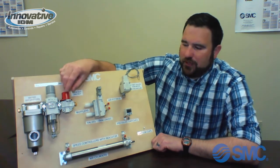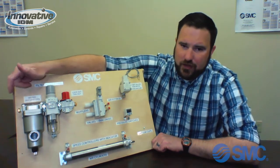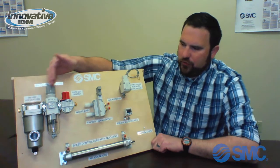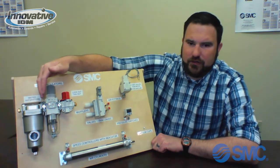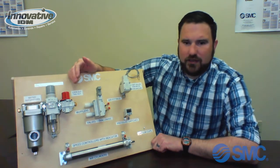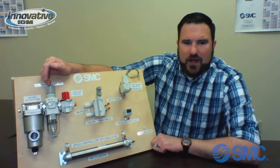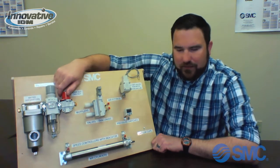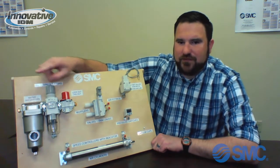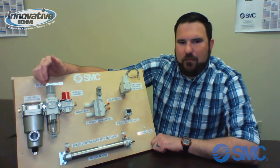Because this is such a useful device, some people actually put this on the upstream side of the filter-regulator-lubricator combination so they can turn it off, lock it out, and then service pneumatic equipment. Right now we still have line air pressure coming through up to this point, so you can't really stop and service the gear here. Well, if you don't have another valve upstream and you want to be able to lock out to do maintenance on the air line, you might put this on that side of the gear. You just want to make sure your filter is one that is capable of the higher speed backflow — meaning one that, if you dump your valve to exhaust, the air from your entire system can flow through the filter quickly and dump out through the VHS. Whichever way you want to go, we can do it for you. We just want to make sure we get the right parts for you in the series.